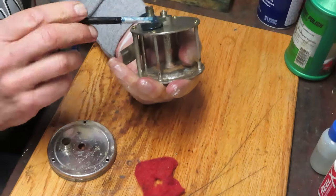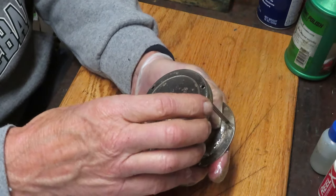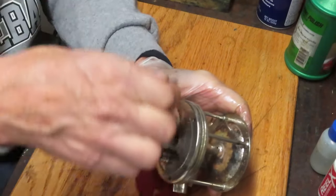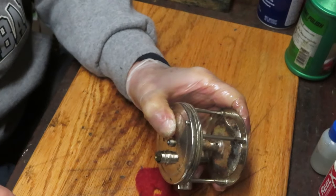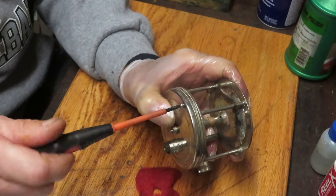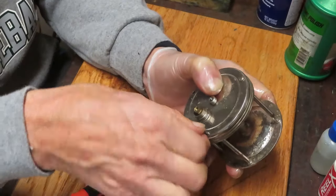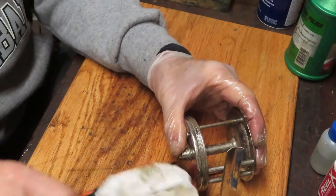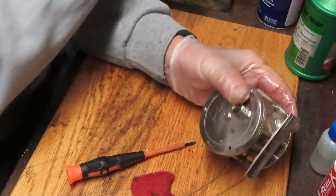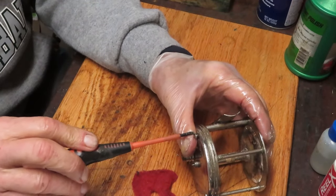We're going to put a little bit of grease on the shaft where that's going to ride through this bushing, and we'll line it all up. Now I can use those bigger screws that I tried to put into the side plate at the other spot. These screws are interesting - they have a very thin slot in them. The message with that is: always match your screwdriver slot to the slot on the screw. Don't try to go with a small screwdriver blade if it's a wide opening - you risk butterflying the screw and making it almost impossible to get out again.